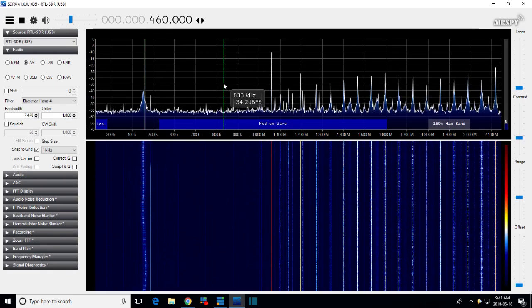It hasn't produced anything visible around 600, but a good chance all I've done is adjust the front end to find a strong noise signal. So now it's conveying a strong noise signal, not at the tuned frequency, just above or below it a little bit, firing it into the IF. Fascinating, and that's about all there is to it.